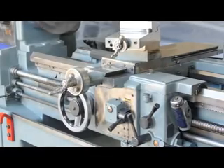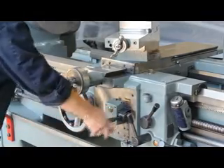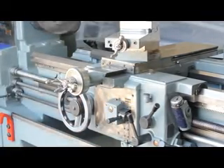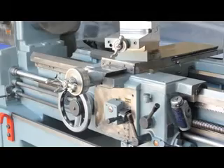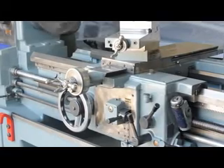Additionally, we'd like to point out that we have threads in inch as well as in metric — 4 to 80 TPI, and 0.5 to 7mm in metric. 35 changes in each. We have 64 changes of feeds. We talked about the overall weight of 7,500 pounds — a heavy pattern machine.